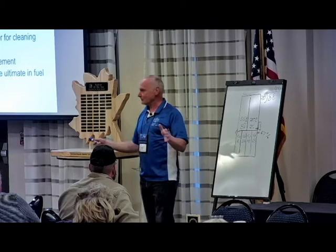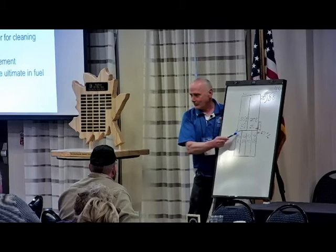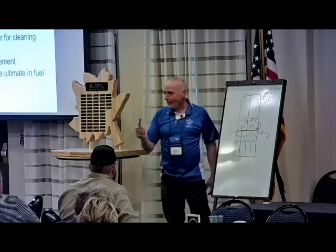30 Brix coming in, and I'm going to just show you something really interesting. If you take this pan and switch sides, what's the differential? We're at 67 degrees, or Brix, on this side. Is that going to dissolve nitre off this bottom? Not very effectively, is it? It helps a bit, but it really doesn't get it.